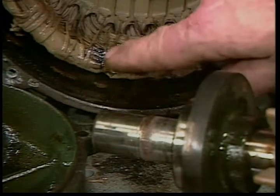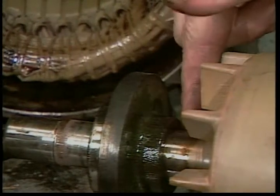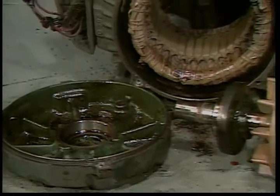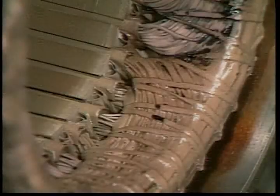Some kinds of insulation material can be damaged by oil which may have leaked out of the bearings. Check for bad bearing seals. The oil may have been left by oily air pulled through an open motor. In either case, careful cleaning is essential, but do not use solvents which could also damage insulation materials. Localized burnt areas on the winding insulation or taping probably mean a short of some kind. The winding should be checked further before the motor is put back into service.